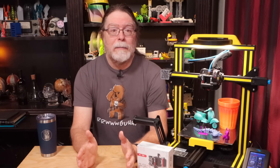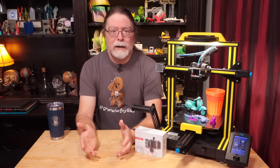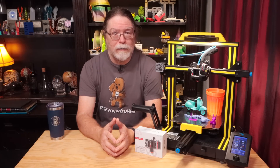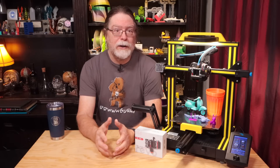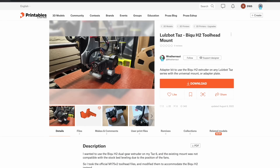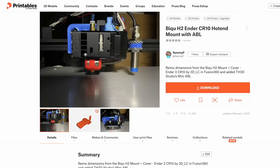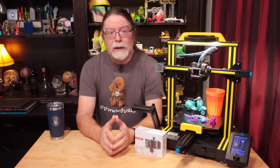Now that I've shown you a few of the things I printed on it, let's go over what I like and don't like about the H2 with the Revo. On the BQ side, I like that the H2 is a lightweight, compact, direct-drive extruder. I like the gear reduction for the extruder stepper motor, the dual filament drive gears, and the fact that the tension on those gears is now adjustable. The filament loading lever acting like a toggle switch makes it easier than ever to get filament loaded or unloaded. I think it's cool that it can be mounted to nearly any FDM printer — I searched on Printables for BQ H2 and found mounting solutions for at least 30 different models before I stopped looking. And because it's a modular system, you can more often than not mix and match components to get exactly the combination that works best for you.